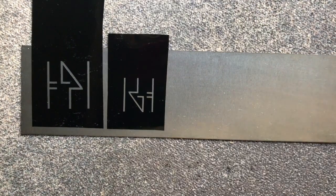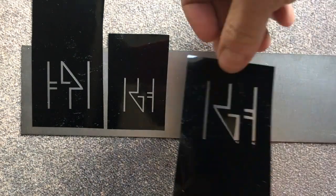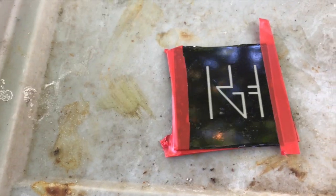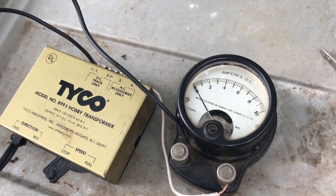You need to use something — it could be a piece of tape that you've cut your design into, or in my case vinyl — just to increase the resistance of the electricity at that point, so that only the exposed metal is going to conduct the electricity, and that's the area that's going to become engraved.